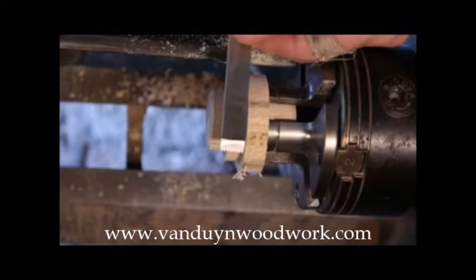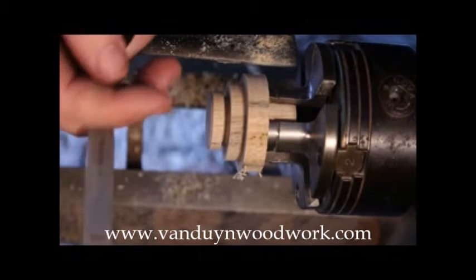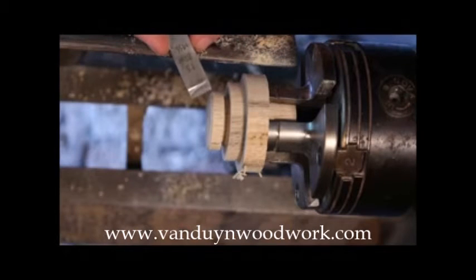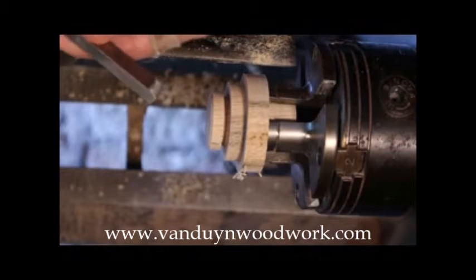So we're using this thread chasing tool — I've got a 16 teeth-per-inch. I like to cut my threads generally somewhere around 300 RPM. The idea is you're going to start off getting your first couple of threads established on the outside, and you're going to want to have the tool angled like this and start working it. Once you start to get some threads developed, you'll start rotating the tool over and just a little at a time — this is a pretty small cutting process. You can start getting a little bit more aggressive once you have all your threads starting to establish.